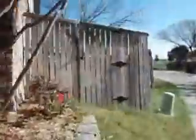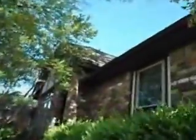This is the roof inspection. You can see here we have soffit vents for the roof. We're going to look at the roof from the ground first, and then we'll have a look at it on the roof itself. Yeah, more soffits, they're continuous soffits, which rather indicates that they're recent, in recent years, because these weren't available to be put on these buildings when this house was built.